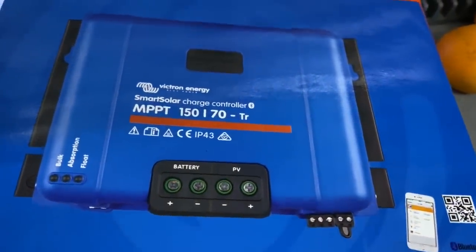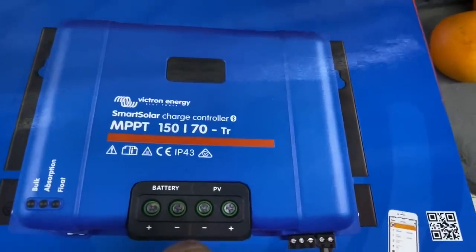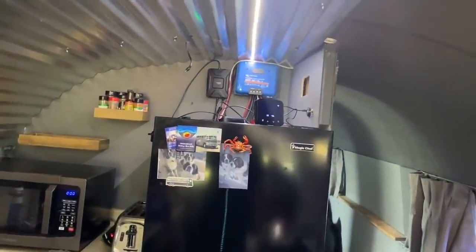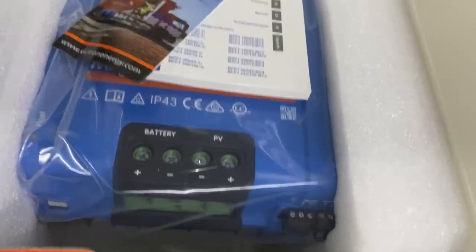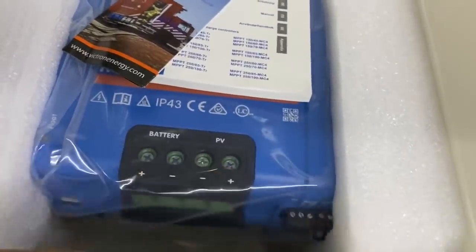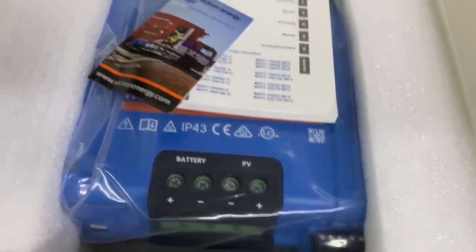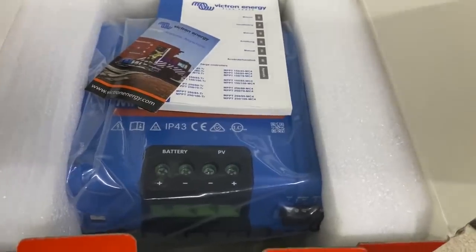This charge controller here is the Victron MPPT 150/70 - I haven't found anything better. It got great reviews, I've been using one for about three months and absolutely love it. It can do up to 70 amps. I currently have another one already installed, and this new one is going to get mounted right next to it, so I'll have two of them - one will handle a little over 2,000 watts and the other 2,000 watts. The install is really simple: battery positive, battery negative, then from the photovoltaic cells a positive and a negative - four wires, that's all there is to it. I just use it via Bluetooth, so it's four connections and the Bluetooth monitors everything. Super great product, great warranty, real reliable. I love Victron - that's why all our inverters and everything is Victron.